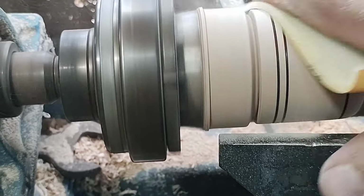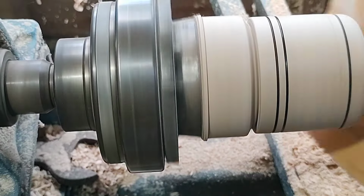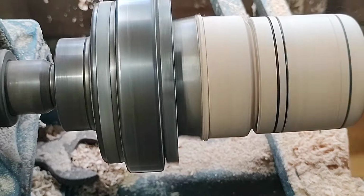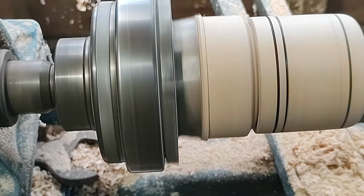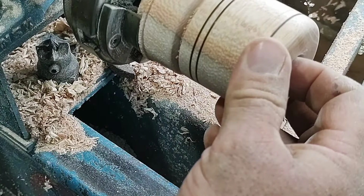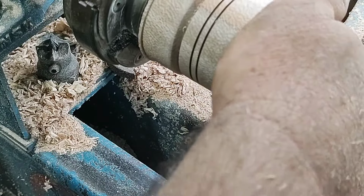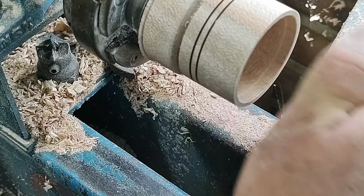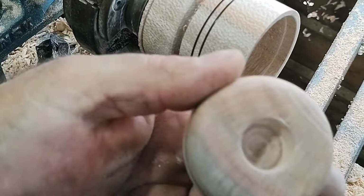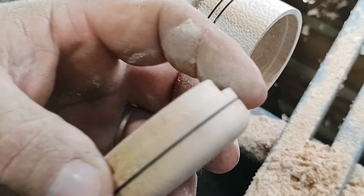After drilling the hole, I went on to give it a good finish sand here. I think it was actually finer than 240, this paper, and it came up nice and smooth and neat. And then I went on to waxing it, as you'll see in a minute. I did that, put that other burn ring on the join in a minute. Like I said, I should have put it back earlier before I waxed it all. My mistake, foolish mistake.